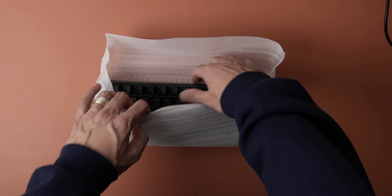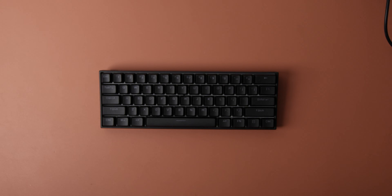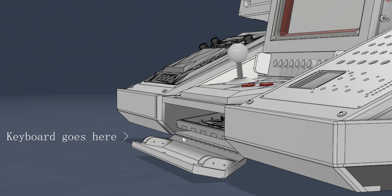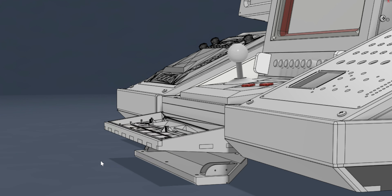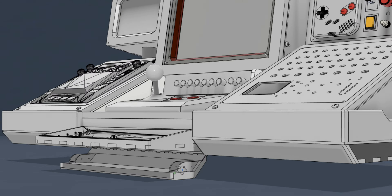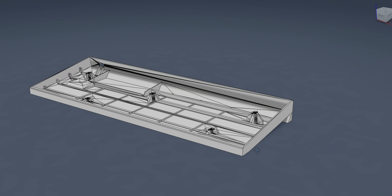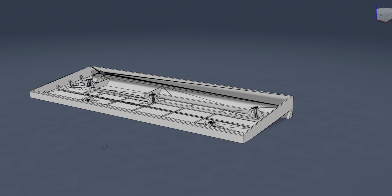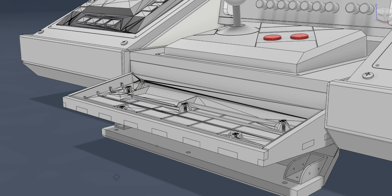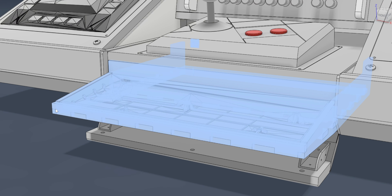It's what's called a 60% keyboard because it's roughly 60% of the size of a full-size keyboard. I chose that because it has to fit in this space that was already here, because the keyboard thing is kind of an afterthought. Fortunately it fits almost exactly. And because the mechanical keyboard community is full of delightful nerds, there are very accurate 3D models of cases on sites like GrabCAD or Thingiverse, so I don't have to do any of the measurements or modeling myself in order to incorporate it into my design and adjust it slightly to fit.